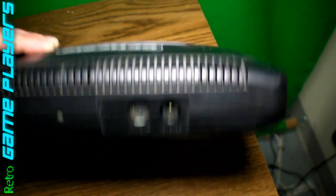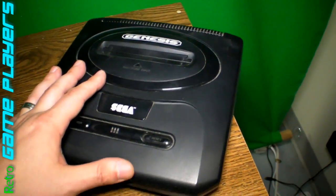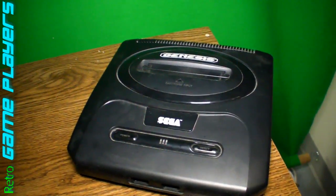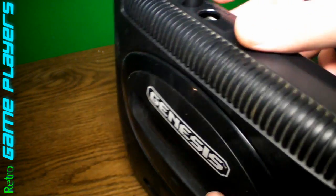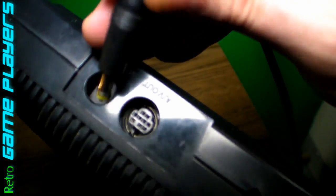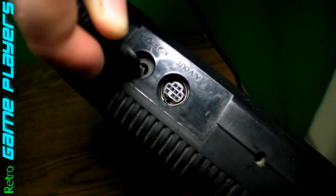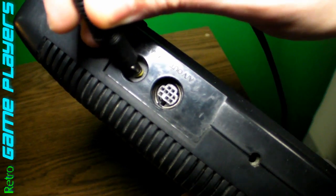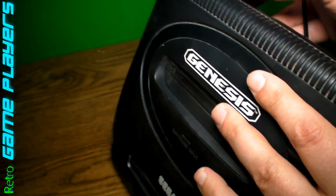What I'm going to do is flip this over and take out these four screws, one on each side. And then there's a few more screws on the I/O shield. But I'll show you how this works — or doesn't work actually. Basically it's just completely loose. So when I plug it in, you can kind of see it wiggles like that. The jack itself actually moves. It's completely loose — look how much that plays around. So we're going to take that out and fix it.